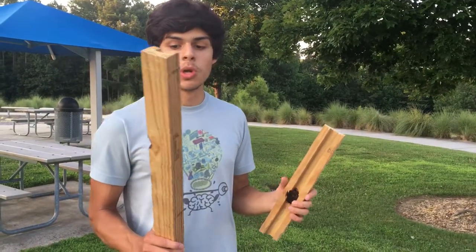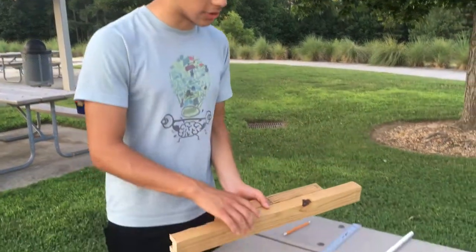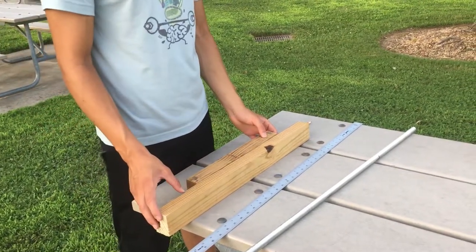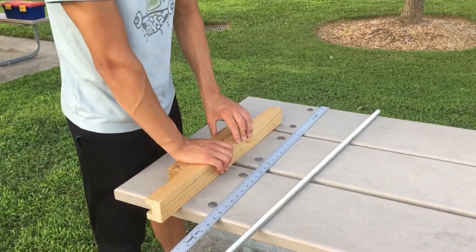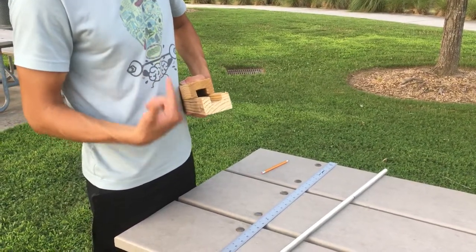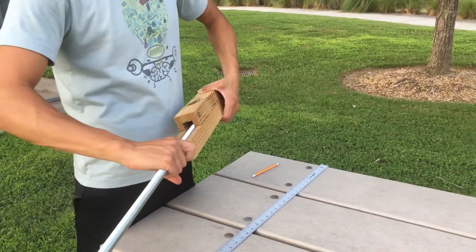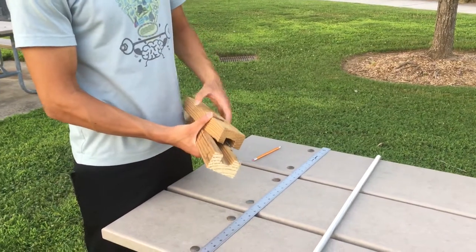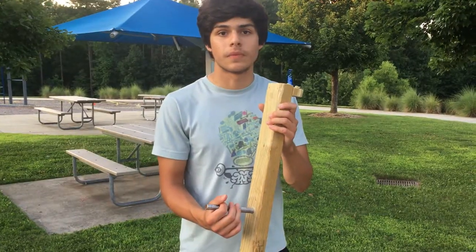Now that the wood has been cut, we have our long 24-inch piece, which leaves us with a 13.5-inch piece too. We're going to use these two pieces for the back of the go-kart. I marked out the midpoint of both pieces, lined them up, and this is how they'll be screwed together for the back. I oriented them so the U-channel faces are facing each other — not away from each other — so the axle is able to fit through. It may seem a bit wobbly but it's actually pretty stable for a simple go-kart.